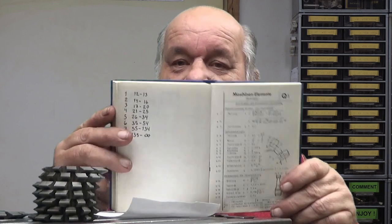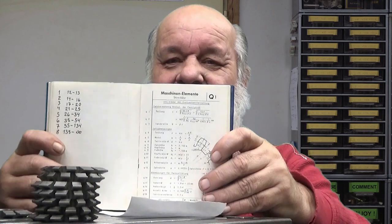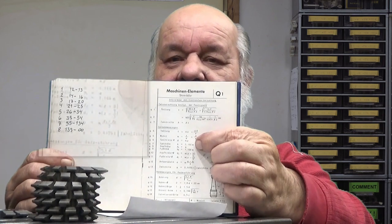So, they have a number because the gear profile changes when you have a different number of teeth. Yeah, okay. That's one thing. You have to choose the correct cutter when you are making your gears. Then, when you make your gears, there is one other thing that you need to worry about, and it is the cutting depth or tooth height. In a module system, this is really easy. Here in the book, it's about there, where my finger is now.